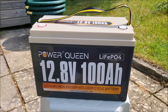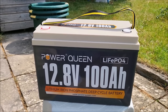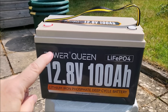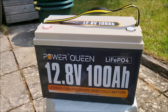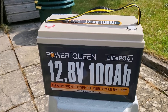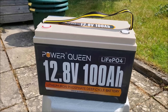There's quite a lot to unpack there because Lithium Iron Phosphate has a nominal cell voltage of 3.2V, so there are four cells in series inside this pack, and four times 3.2 is 12.8V, so we know this is a 4S battery pack. Now 100Ah — we don't yet know whether this is gross capacity or usable net capacity, but I intend to find out. The battery weight is 24.25 lbs, which is 11 kg.